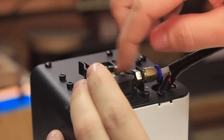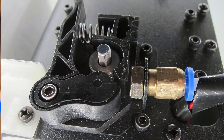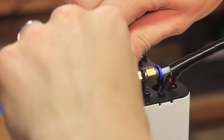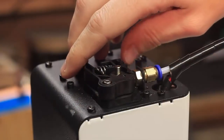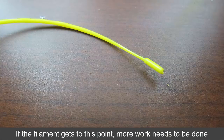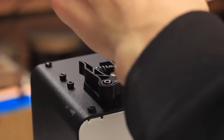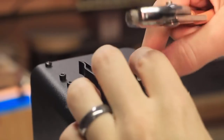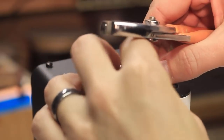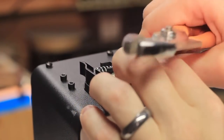Here at the top is where the motor feeds the filament in. You probably won't have a problem here, but your filament will be coming through and be stuck. While the printer is still hot, squeeze this in and try to pull the filament out. If you can't, you can cut the filament or grab that nut with needle nose pliers, loosen this brass fitting and it comes apart — though usually the problem is lower down.